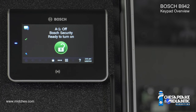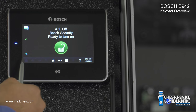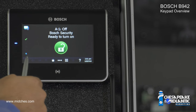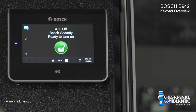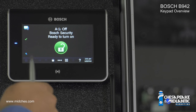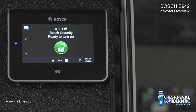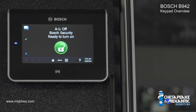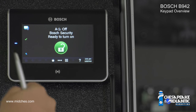This is the ribbon bar. Starting from the left, this is the home button which takes you to the main screen. This is previous and next — how you navigate through your options on the menu. This is escape, which will bring you back to the previous level of the menu. This is the shortcuts button, which allows you to access functions you use the most. Your alarm company programs these buttons for you, so if you want a new shortcut, contact your alarm company.